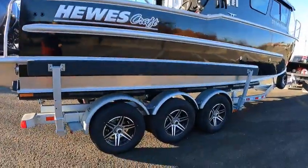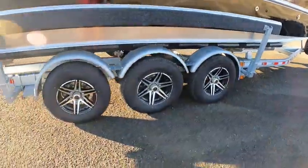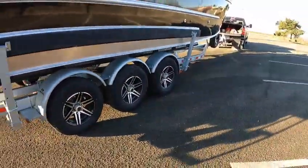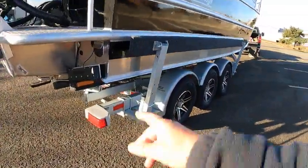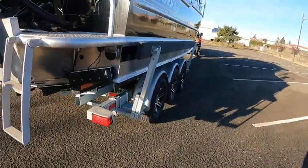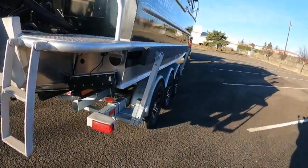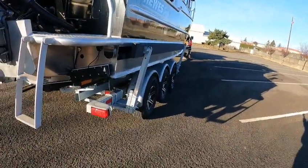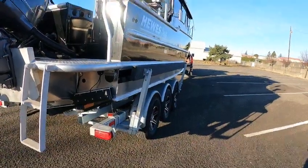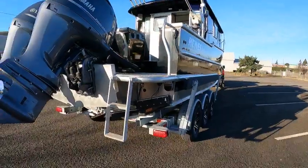Gear bath oil hubs, good. Brown good, white bad. Disc on all three. Surge brakes, you got Zip Wakes. These are automatic, so you really don't need the trim tabs on this boat that much anyway, but you can go automatic. So it helps with your autopilot in a way. And I'm gonna test that out when I'm out there setting up the autopilot and all of the displays and his depth finder. He's got the active 3-in-1.